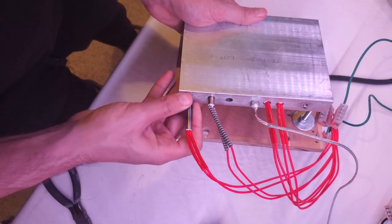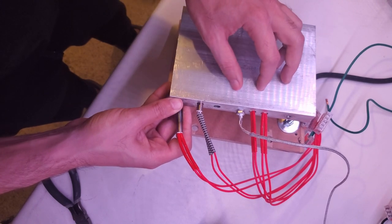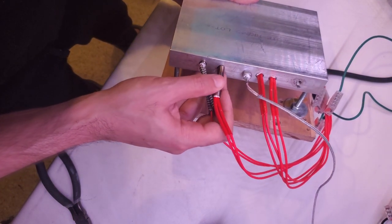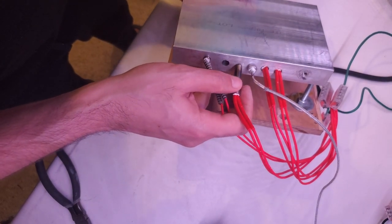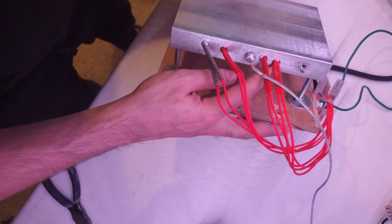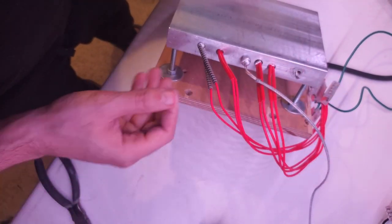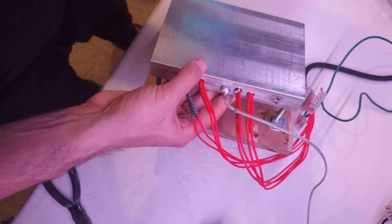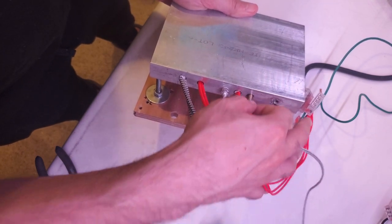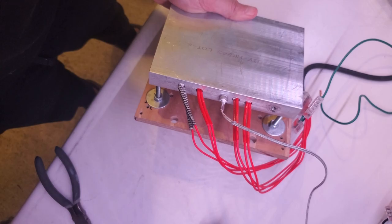Conversely, if the heating element is really far away from the temperature probe, it'll take a long time for heat to reach the probe, and one portion of the hot plate will be hotter than another, giving you inaccurate readings. You need to strike a compromise depending on your design and element size. For this heating element I have about an inch of spacing. On my first hot plate I would evenly space the heating elements if making it again, for a much more uniform heat distribution.